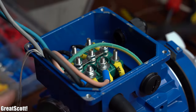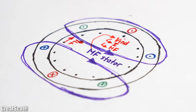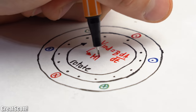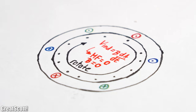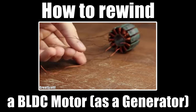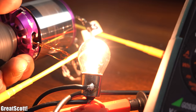When in motor operation — aka the motor's coils are being powered — the induced voltages into the conductors create a magnetic field which repels the magnetic field of the coils, and thus a rotational force is created and the motor spins. The problem is that when just the rotor is spinning there is no magnetic field which could cut through the stator coils and create induced voltages we could use to power stuff. So we need to add what the rotor of a BLDC motor already comes with: neodymium magnets. I actually modified the coil windings of a BLDC motor in a previous video so that when used as a generator it can output a high enough voltage to power certain loads — and yes, this is also proof that our induction motor just needs some magnets.